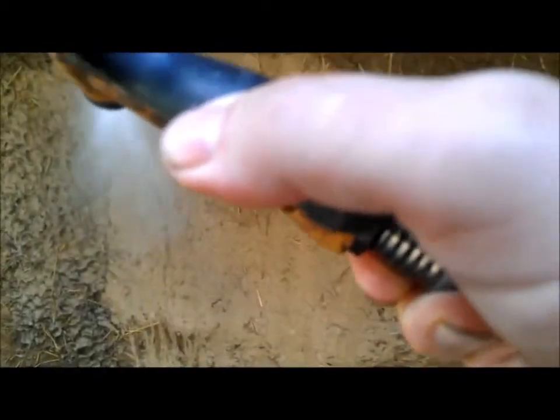And even in spots where this rough plaster is extremely porous, it has soaked in the Terrakote and given us a water-resistant finish. I wasn't able to erode this finish away. The water ran clear as it came down the side of the wall. Very impressive, and we're looking forward to doing more tests like this in the future.